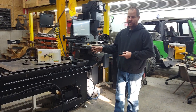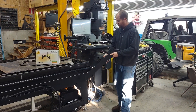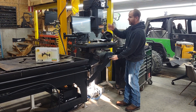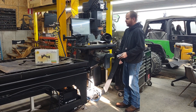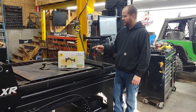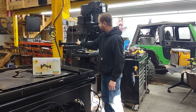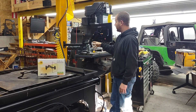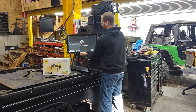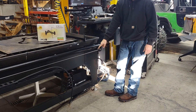After installing this table, the first thing I knew I had to change was the monitor mount. It comes with this rigid monitor mount that mounts here on the corner. As you can see, I have other machinery and everything's real tight in here, so I knew I was going to have to move that. I got this fully articulating bracket off Amazon — I'll put a link in the comments. I manufactured this bracket and cut these pieces with the actual plasma table here. It's made out of quarter inch, basically an extension so I can move this around up and down. Still works great.